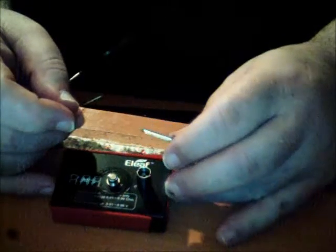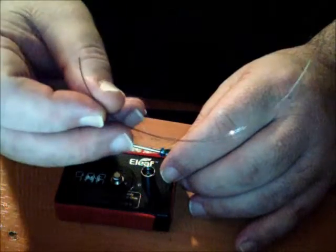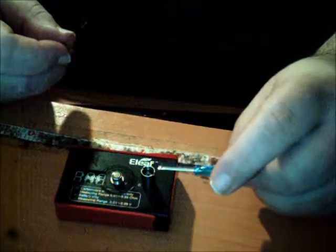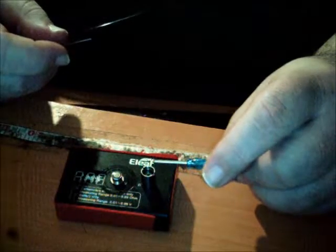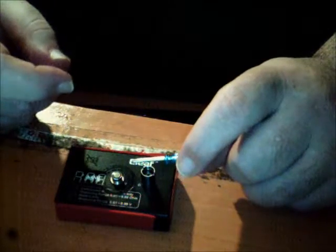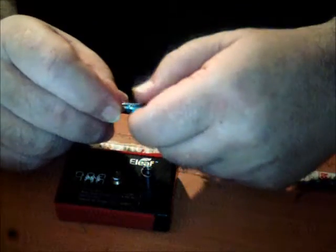Learn your resistances and learn your safe zones. So first thing we have the 8 inch length of 24 gauge Kanthal A1, and we have the little blue screwdriver that comes in your kit with your rebuildable atomizer. I've already measured the resistance using steamengine.org, and I know how many wraps I need to do — it takes 7 wraps. You're going to take one end of your wire and pin it with your thumb to your screwdriver.